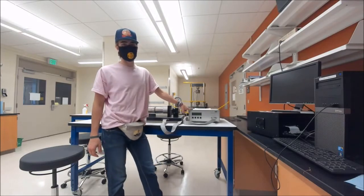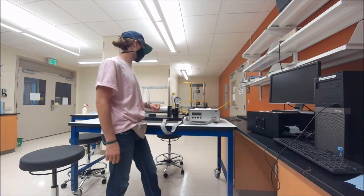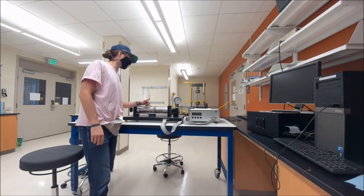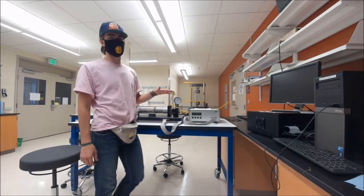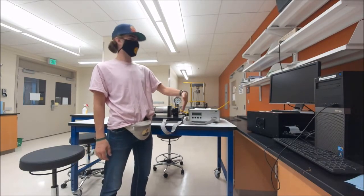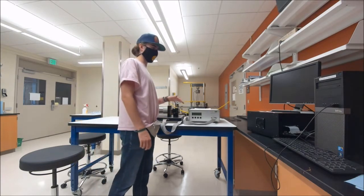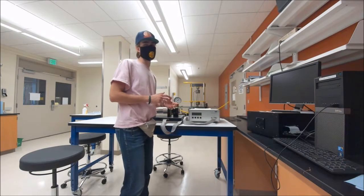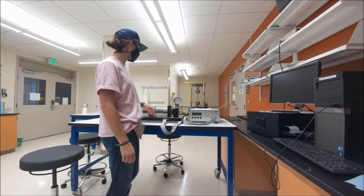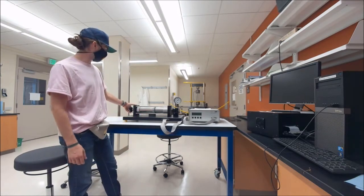This is just like the one we used last week, except it can handle multiple channels. And so, on our pressurized cylinder, we have 5 strain gauges oriented at 0, 30, 45, 60, and 90. And by taking measurements at all of these angles, we're able to get a full picture of the strain state of the cylinder. The cylinder has 2 configurations based on the plunger position.